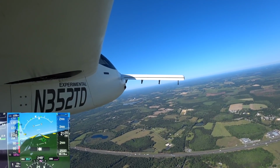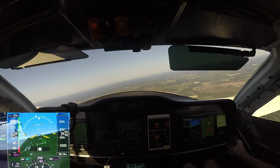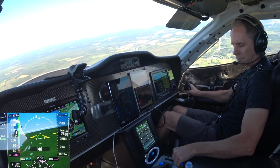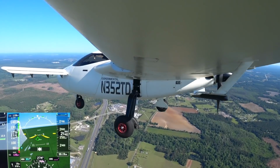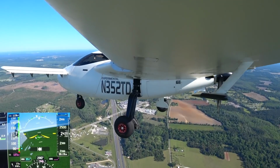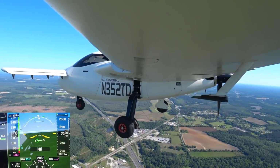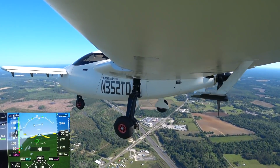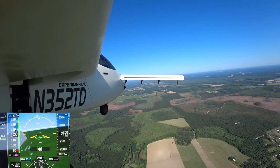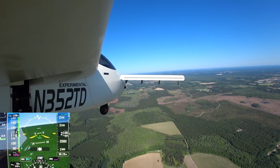But I think if I go to a heavier weight oil, as I said, a 10W40 or something like that, then potentially the oil's going to stay thicker at these higher temperatures, and then the governor is going to work better. So at least that's my thinking. And as I said, I'm talking to a couple of different people and getting some opinions on this. And obviously, if I step up to a 10W40, it's not going to cause any problems. And if that improves things, but not quite enough, then I could potentially go to a 20W50, if I can see if that's approved for this engine. But I know a 10W40 is totally approved for this engine.